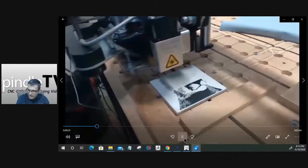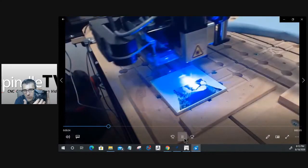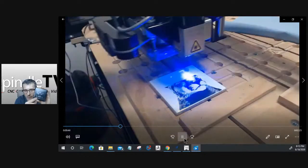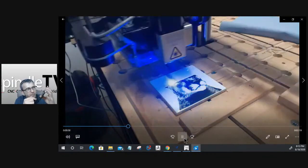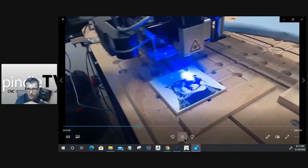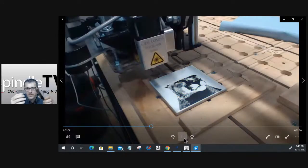So the Incredible Hulk, now that's in the paint. It's gone through the black paint to reveal the green paint, which we can't see, of course. And I've clear coated it afterwards, but I needed to go a little bit stronger on power. We're going to talk about the power setting for the Hulk and what I would change in a second. I should have gone a little bit more power or a little bit slower speed than the 1200 millimeters a minute. Instead of 48 inches per minute, let's say maybe bring it down to 40 inches a minute or so.